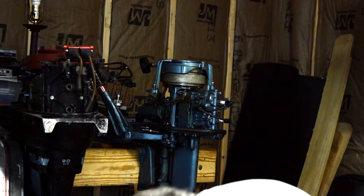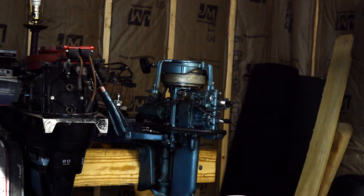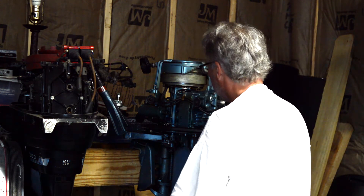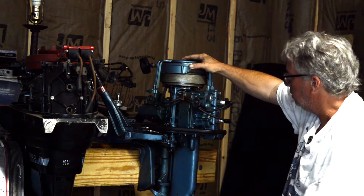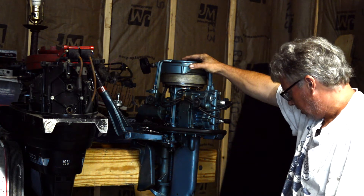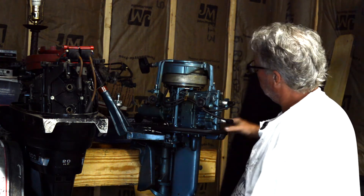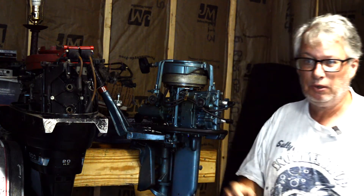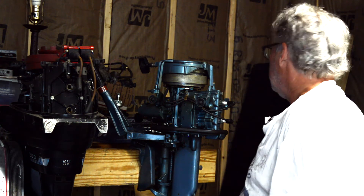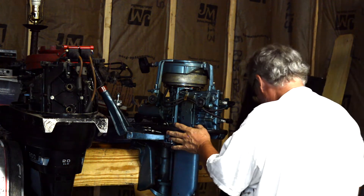The hose is very greasy. If you keep it original you're gonna have to - and who knows, this hose might have been okay if it didn't see any days of ethanol and wouldn't have had ethanol abuse. So let's hope for that. We know we got to do an impeller, and we need to check compression. We could put it in a tank and decide what to do, but I'm pretty sure we're gonna need a new impeller. I can spin it with the drill to check for spark. It's a very clean motor.